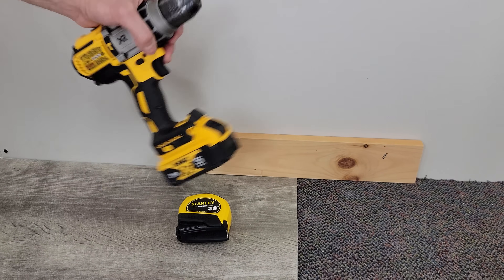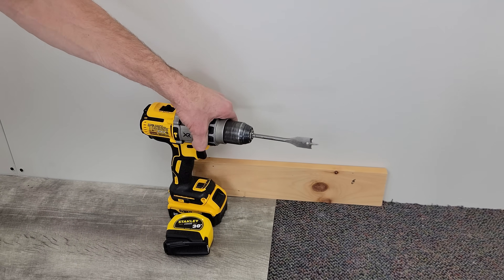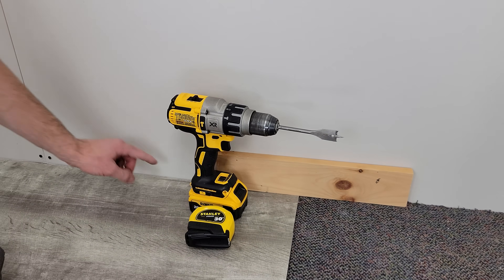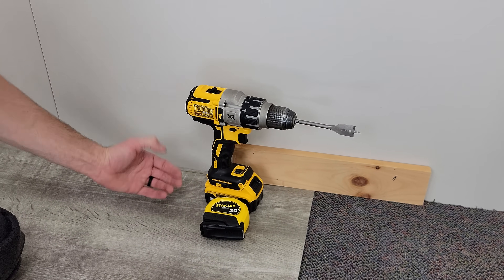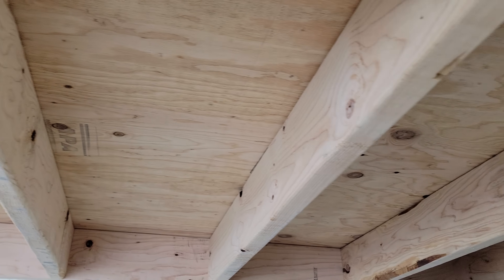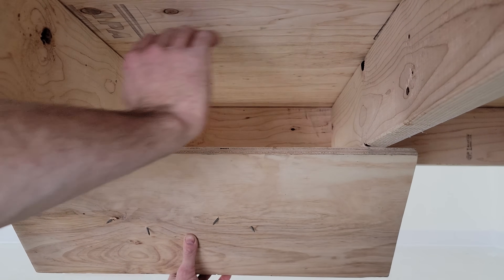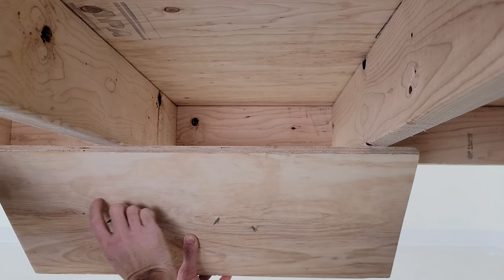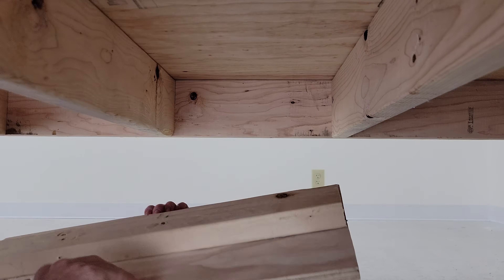You could drill a speed bit up from the crawl space, making sure to drill up through the center of the 2x4 wall base plate. The problem is you don't really have good reference points in the crawl space and you need to absolutely make sure you're not drilling up through the floor. When you remove the insulation down there, the plywood may look bare, or it may have nails where you can tell where the 2x4 wall plate is above it.